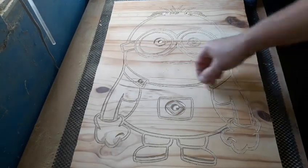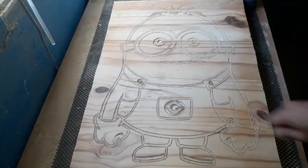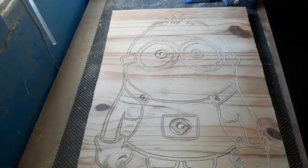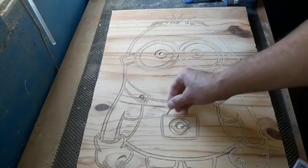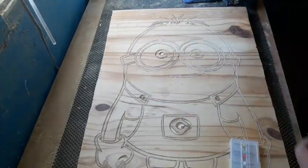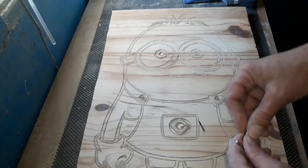Right, you can just about see we've gone all the way around all the lines with the CNC bits. It's quite powdery, this pine wood, but that's just the way it goes. It's quite compact in there so you won't be able to see a lot, but I can assure you we've gone around it all. We've removed small little sections — that's just a nice little marker for when we put our end milling bits in. We're going to pick one that fits inside the lines themselves — we can go for the biggest one out of a pack of 10 and we know it'll fit nicely in between.